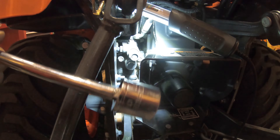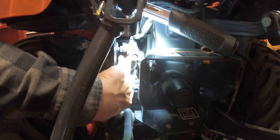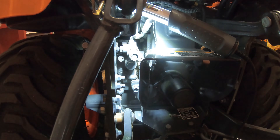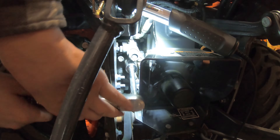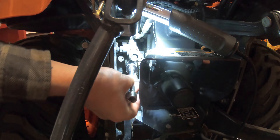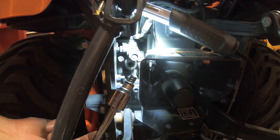Here we are at the back of the tractor. I've got a 22 millimeter socket on a six inch extension, three-eighths drive. The bolt I'm going for is this one right here — this is the relief valve, it's a 22 millimeter. There's also a 22 millimeter up here, but it's not going to be the upper one, it's the lower one down here. You can see some of the paint is gone because I've had this out a few times. I'm going to take that out and then we can get our shims in place. You will lose a little bit of fluid when you take this out, but it won't be much. The big thing is not to lose the spring or any of your shims when you pull it out, so you kind of have to tip it down and be careful — just like that. And there is your relief valve.